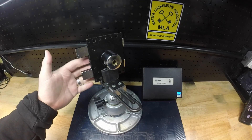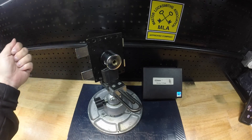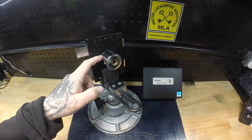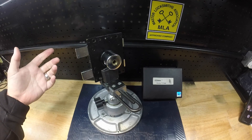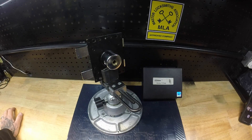The reason these were fitted, I'm assuming, is because they're extremely versatile for master keying — so one key could open everything. The limitations meant no one else's keys would typically cross over, because these rely on 16 pins: four rows of four. Due to the variations in the depths of those pins, that gives a possible key combination of 4.3 billion possibilities — extremely vast. If you wanted to sit and test every key, you probably wouldn't get a quarter of the way through.